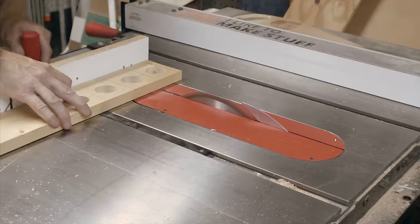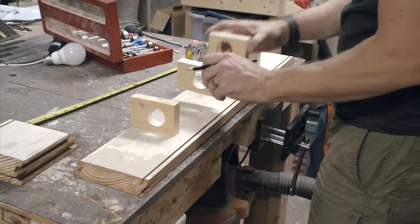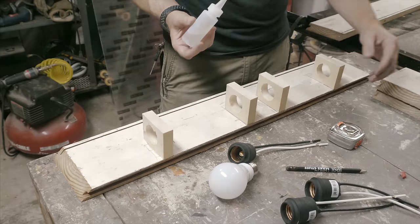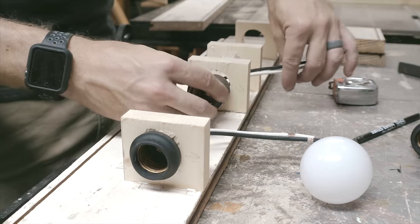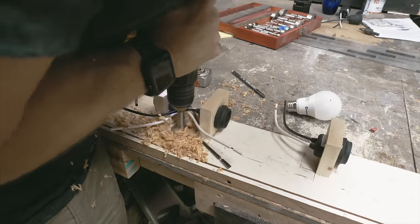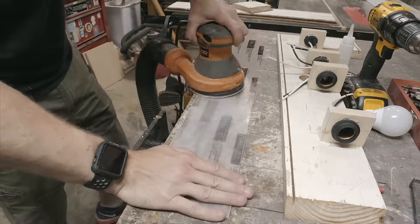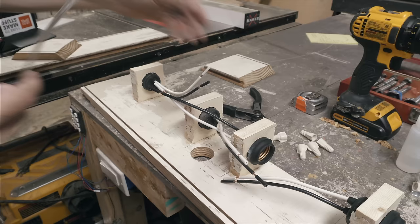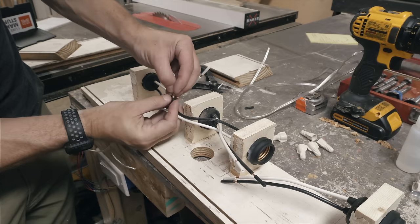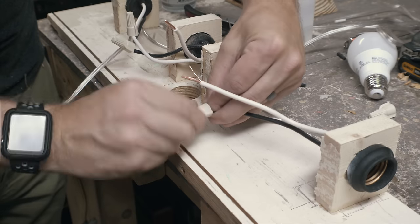After I had all the holes drilled, I took it to the table saw and cut it down into individual pieces. I laid out the four brackets on the back piece, leaving enough space for the bulbs, their fixture, and for the wiring to come out the back end — I ended up with two lights facing off onto each side. I used CA glue to hold these in place because the surface was painted, and a little bit of glue on each fixture to slide them into the hole. These were pressure fit, but the glue just helped keep them in place to be safe. I also drilled a hole right in the center of the back panel that lined up with where the wires came through from the wall. To frost the Lexan, I pulled off the plastic sheeting and went over both sides with an orbital sander — this scuffs it up and adds a nice diffusion. I cut two short sections of lamp wire to connect all the fixtures together, twisting the white wires together with a wire nut, and the same for the black wires on each side, essentially taking four pairs of wires down to two pairs.